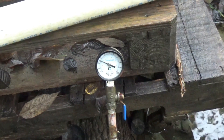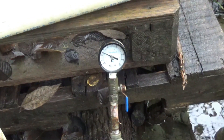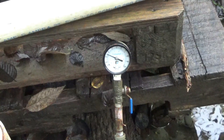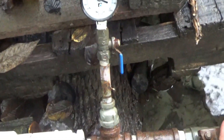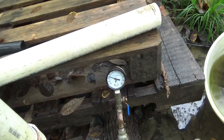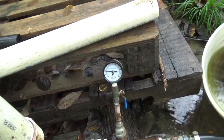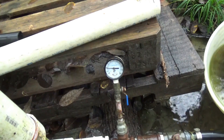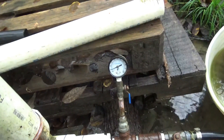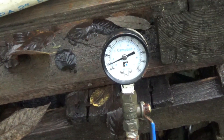Based on that calculation and knowing your approximate elevations along the delivery line, you can find the general area to look for your leak. I'll bleed off some pressure here to simulate what I saw the other night: the pump would pressurize up, then after sitting a bit the pressure would drop to around 10 psi.